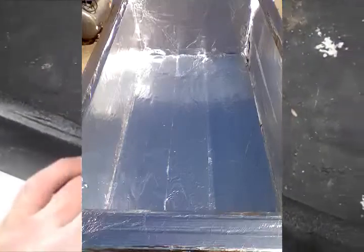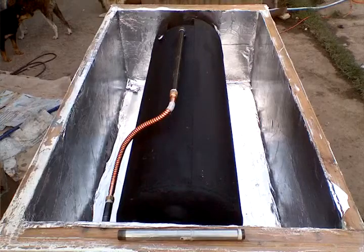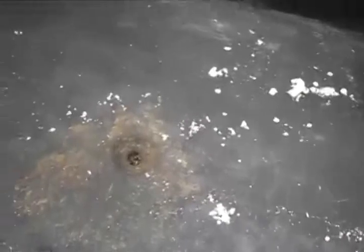Here's a look at the inside without the tank installed yet. One thing the old design had was a completely reflective surface. The reason for that was I wanted to see if I could get as much sun as possible on the entire surface of that tank to generate hot water. It was a pretty good design, but this time I painted the whole inside flat black, because doing so should raise the ambient temperature inside the box while the sun's shining on it and create more hot water. I need to touch up where the paint peeled off, but other than that, let's move on.